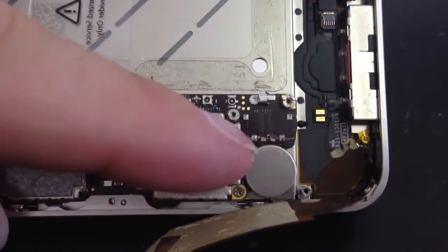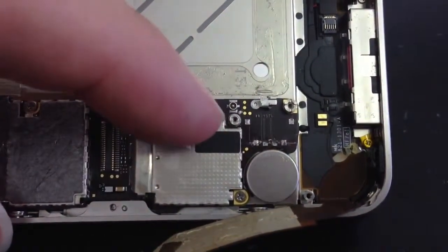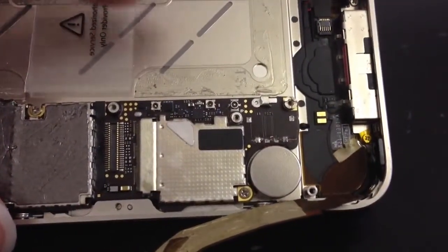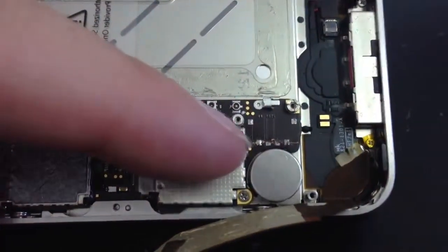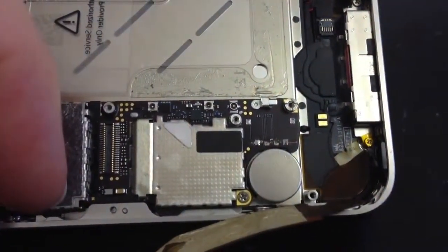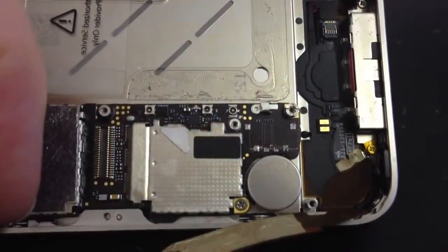What we have here is the area that the battery connector sits in — I've just tidied it up a little bit. I've found that the two middle pads are damaged, so we're going to have to fix that issue. The other four pads are ok. I'm going to solder a new connector to those pads, then fix the issues with the two damaged pads in the middle.